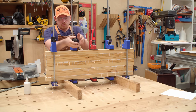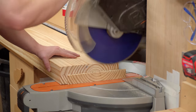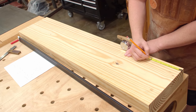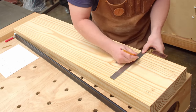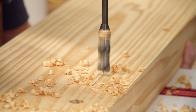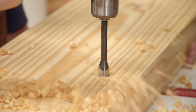I started by milling some material for the legs and gluing together the four leg blanks. With three of the faces already taken care of I continued cutting down the top panel to its final size. I needed the completed legs to size the dados for the leg to top connection and because they were still in clamps I started drilling the dog holes instead. This is an overdrive bit — it has the speed of an auger bit but the cut quality of a forstner bit, and these bits produce very clean exit holes.